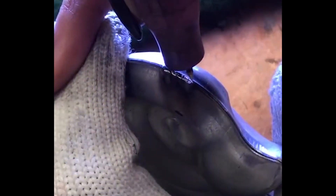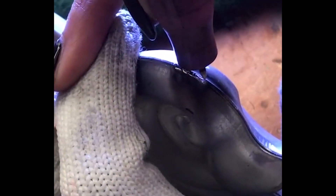The tungsten needle should be kept sharp during use. If the tungsten needle becomes blunt, the current becomes less concentrated, making it difficult to maintain arc stability during welding, and the arc tends to diverge.